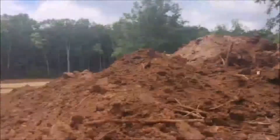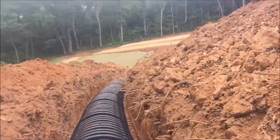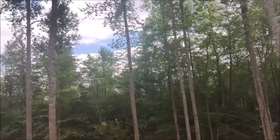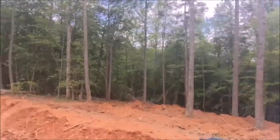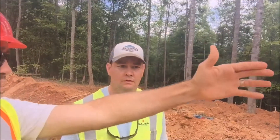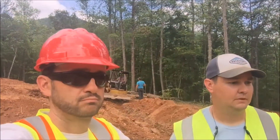You can see the root matting is about 12 inches deep. One concern here is the trees and whether the roots are going to affect these chambers. Only about three trees — the willow, the Leyland cypress, and the maple — after about 20 years will create a matting on the bottom of your chamber. The poplars in the field now are not a concern; everything in the field is poplar. We do have some maples on the outside of the drain field that we want to take out to keep them from creeping in. We want to remove them carefully, pushing them away from the field — if those trees fall on the field, we risk busting a pipe underground or tearing up a chamber.